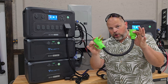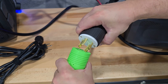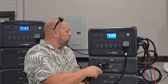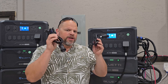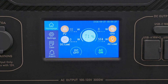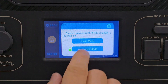This is a four-wire hookup rated at 240 volts and 50 amps, which is more than enough to handle anything pulled by the AC300s. Just plug it in to your outlet. You'll want to save the original 15-amp cables too, because if you ever take this somewhere without a 240-volt connection you can still use those. The settings I'm about to show you will need to be done on both AC300 units.